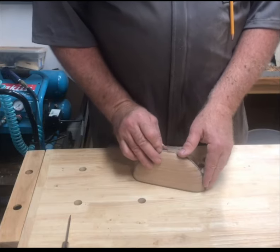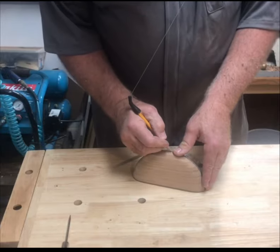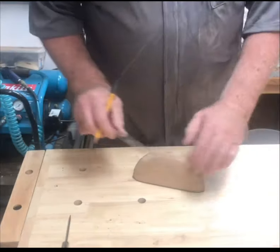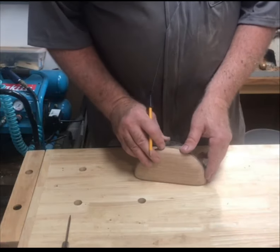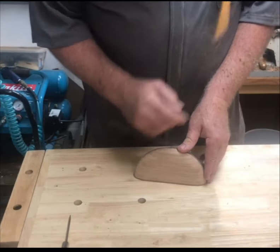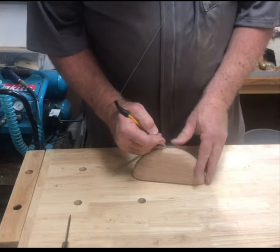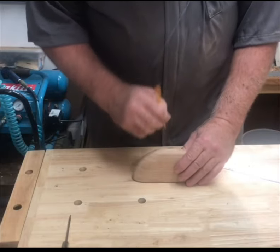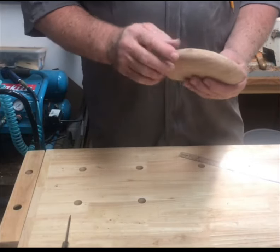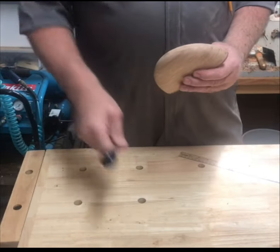In this case, it's about 5.5. So I'm going to mark it at 5.5, turn it around and measure from the other side to 5.5. And then we'll split the difference between those two measurements. So I'll go ahead and use my awl to mark that point, and then we'll go to the drill press